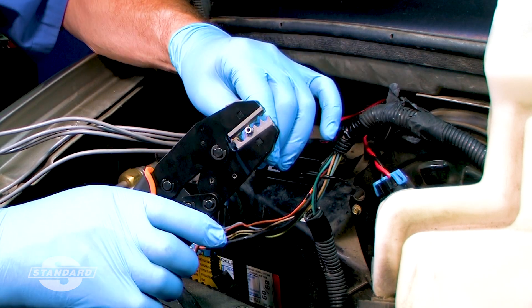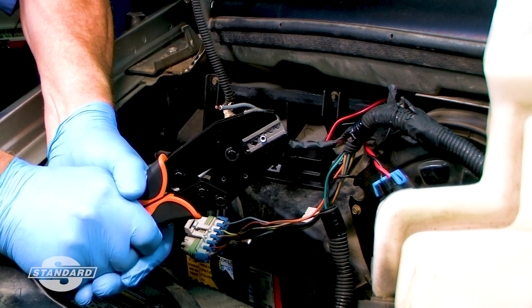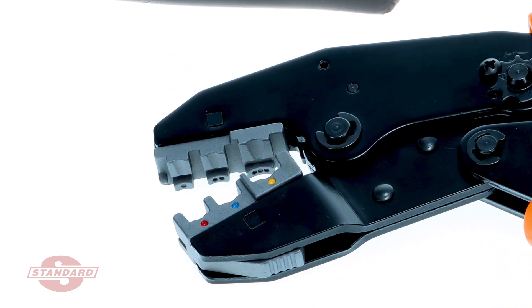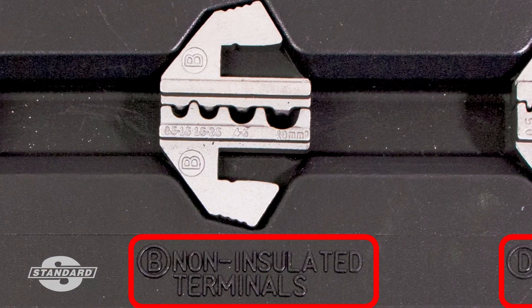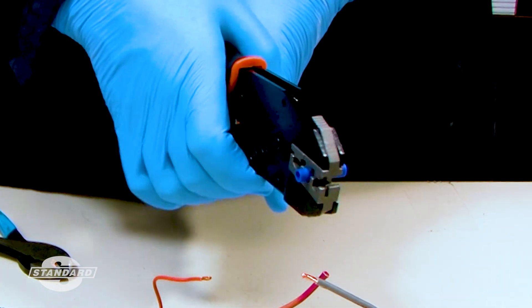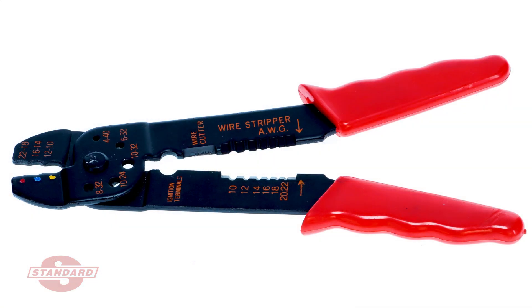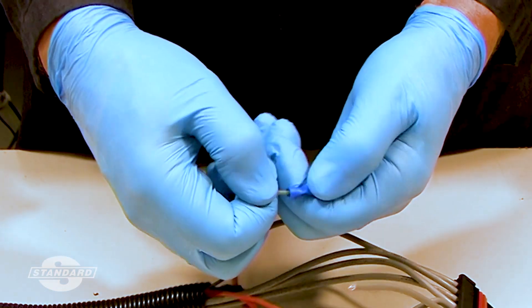Use a quality crimping tool similar to the one shown here. A quality tool has wide crimping jaws and restrains the diameter of the connector as it is being crimped. Either of the tool styles shown here will produce a much higher quality crimp — note the thickness of the tool jaws. Ideally, the different connector types call for custom crimping jaws designed for that specific connector style. This tool has a ratcheting mechanism that enables the connector to be held gently in the jaws while the wire is inserted into the barrel. An inexpensive crimping tool like the one shown here simply squishes and flattens the connector, resulting in a loose crimp with excessive resistance that will separate easily.